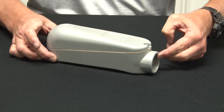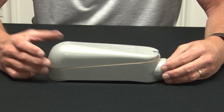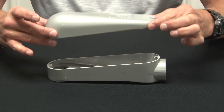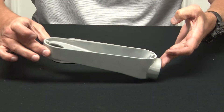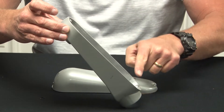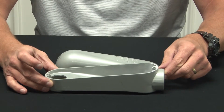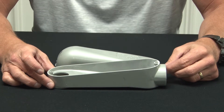What's unique about this product and beneficial in the field is that it has an angled body. As you can see, I'll remove the cover and gasket. The angled body allows your wire pull to have a nice soft bend radius, which makes it very smooth and easy to make a 90 degree turn — especially when you're dealing with service entrance cables that are often very rigid and difficult to pull.